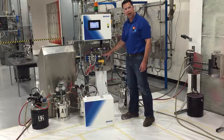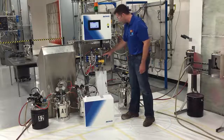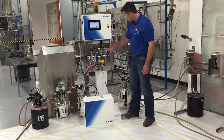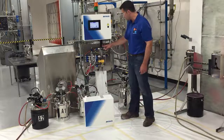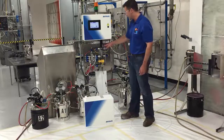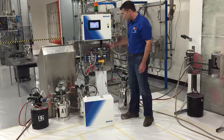Our biggest recommendation is to never flush this line out with catalysts if your process can handle that. We also have an oil reservoir at the top of this B pump. That oil is an iso-oil that is compatible with any of the catalysts that we have, and this essentially creates a final barrier from the air getting into the system itself.